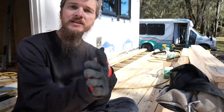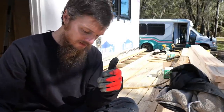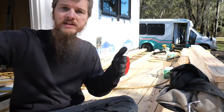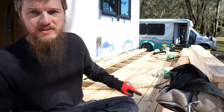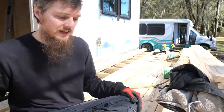And since the wood isn't perfectly straight, there is a little gap on its own, probably a 16th or so, just because it touches in different spots. So it's not like dead tight right now, but watch it. Over time, I can come back to this and I'll show you. Over time, these tight gaps will be huge. That's why I'm not gapping.